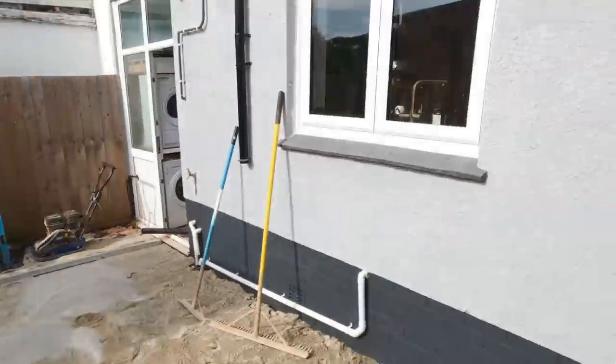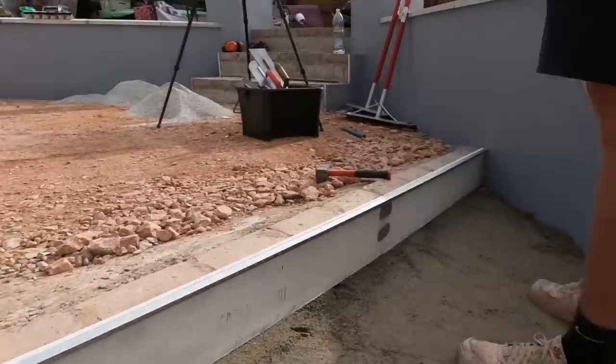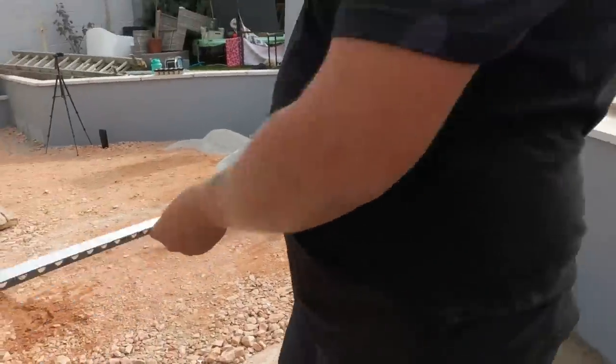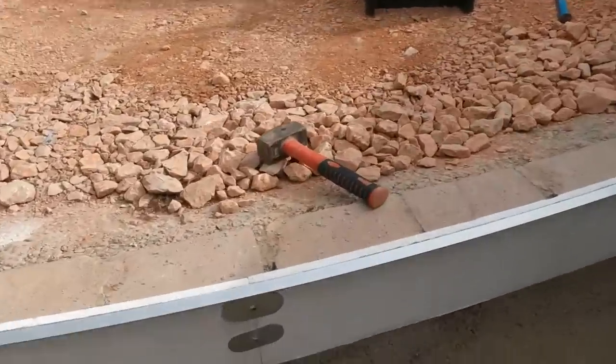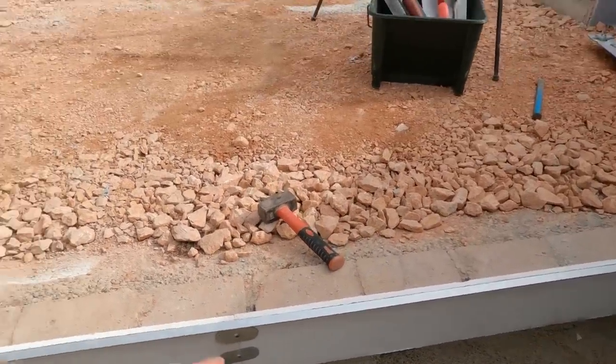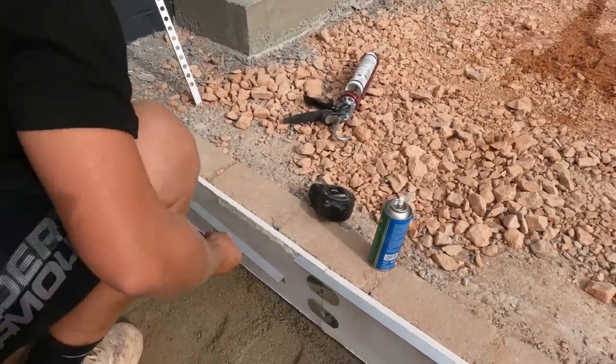I've got a shorty. So we're quickly beading up this riser here. We're doing it in place because, as you can see, it's quite a long one, so it's very tricky. You've got a sharp angle down there as well. We've put some reinforced clips on just to reinforce it. So what we've done is we've glued and activated all the joins, and then as you see now, we're spraying them with activator because we want to get them done today.